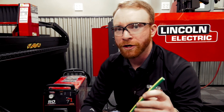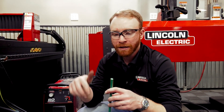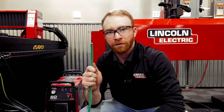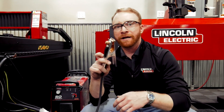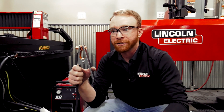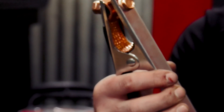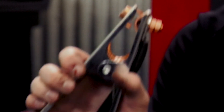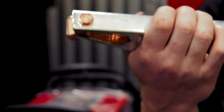This green cable is your earth ground. You're going to need to drill a hole through the concrete and put about an eight-to-ten-foot copper-plated steel ground rod into the ground — this is what connects to that earth ground. This other cable is your secondary work lead. If you're cutting on rusted or extremely painted material that's having a hard time connecting to the arc, go ahead and clamp this directly to the material itself. But the majority of the time you won't actually need to use this.